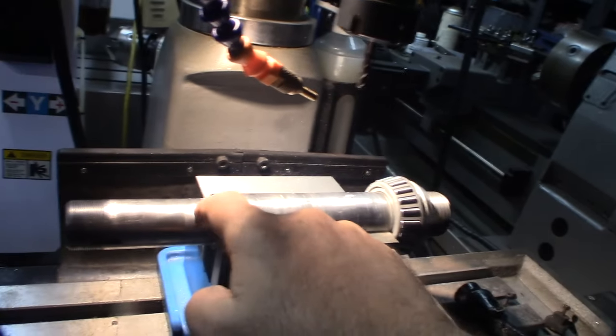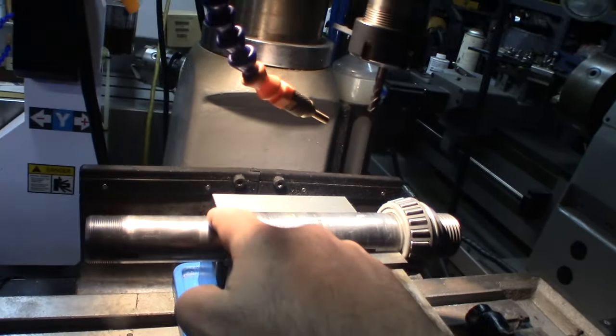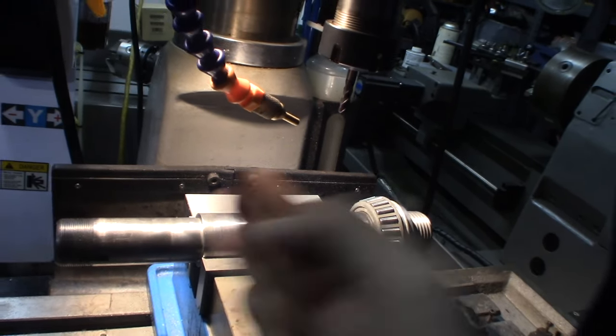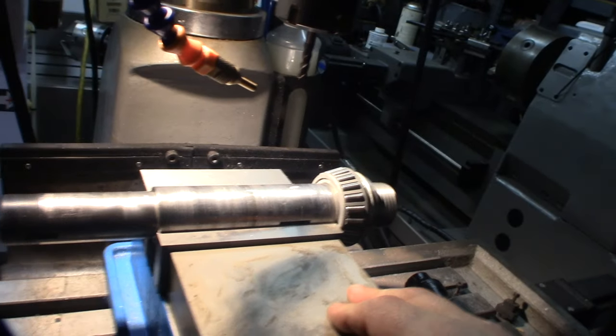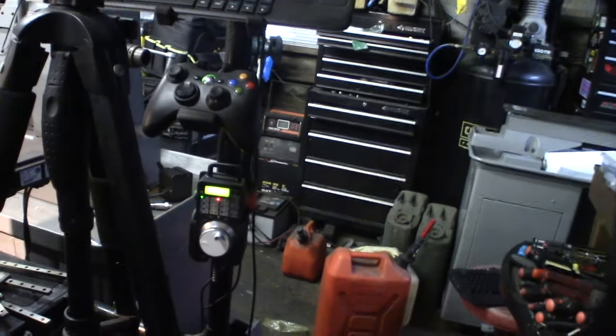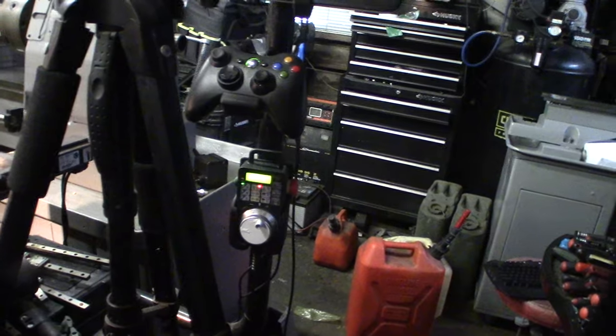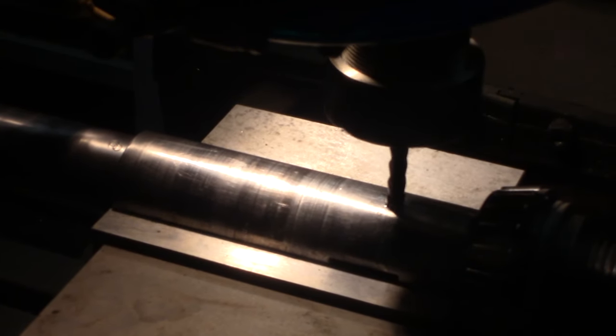There's a set key right there so it's always going to be in the same position. I'm going to slightly recess this spot so if the set screw does mark it, it marks it below the surface. You can't find these gears - the thing is 50 or 60 years old. I 3D printed a V-block to hold the shaft in the right position. Even though this machine is set up for CNC, I'm going to use my MPG handwheel to slowly move the end mill in. I'll throw some WD-40 on there - I've got a four-flute carbide end mill and I'll just go back and forth to create a slight flat spot to recess the set screw.